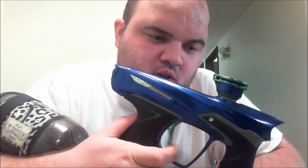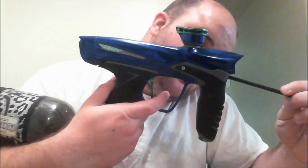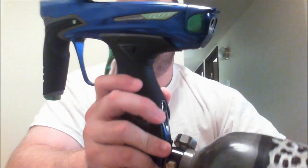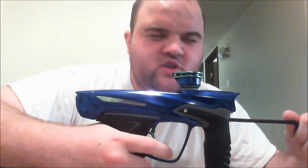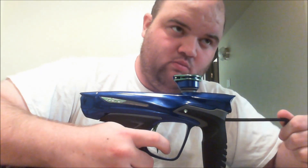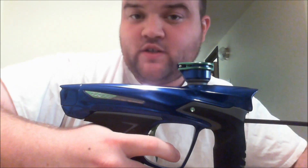I don't subscribe to that. What I do — right now it's just solenoid clicking, there's zero air getting to the solenoid. The LPR is turned off, just solenoid clicking. So what I'm going to do is turn the eyes off — that's eyes off. And we're going to slowly back this out until we hear the solenoid kind of puffing on air a little bit. Okay, there it is. Once again I don't know if you can hear it, but this is what I call zero turns right here.